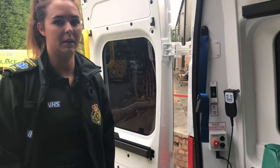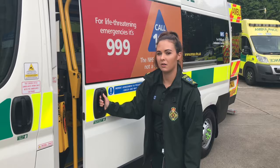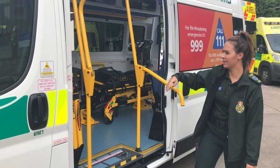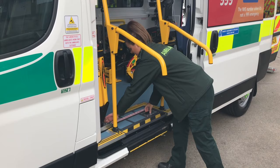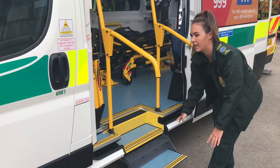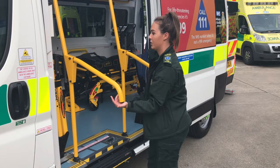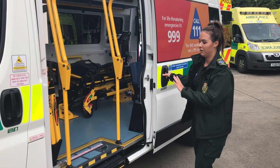Now I'm going to show you the side step for the ambulance. The new doors also actually have two catches — the first one is just here, and then the second one to close the door. To open up the step, you need to open down both handrails just like this. There's a catch which you pull, and then a lever, and the step opens just like that. In order to close the door, you must make sure you close the step back up using the lever to pull back so that it locks in. Push the handrails back up and then you can shut the door. If you don't close the handrails and the step, then it will damage the door, so make sure you do that.